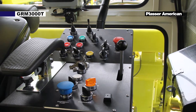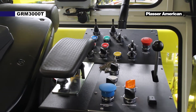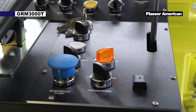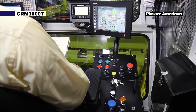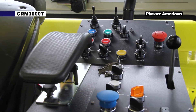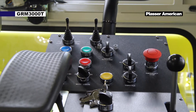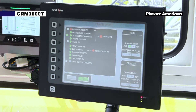On the right side we have the B52 panel and the right hand touch screen monitor PLC screen. The lower part has the service brake, ignition key, and emergency pump control as the major functions. The upper part has the emergency stop, throttle, line reference, Atlas control functions, left side rail hook, and tamping unit controls. The touch panel is where you access different screens for control and monitoring functions.